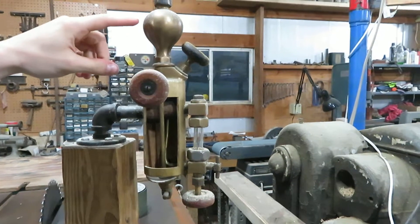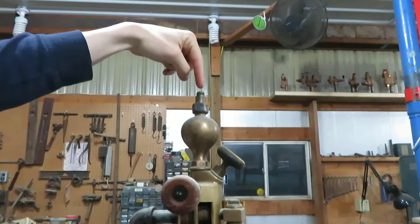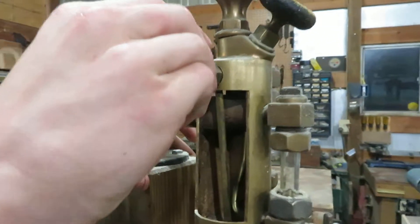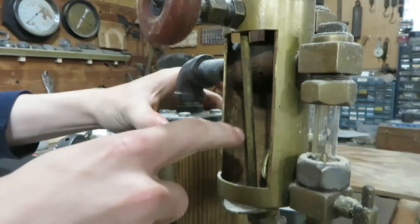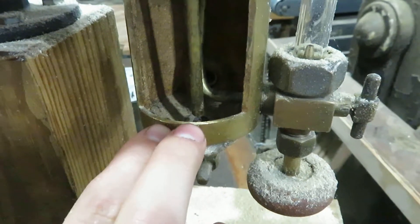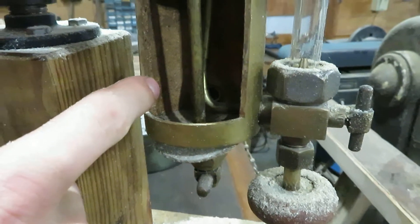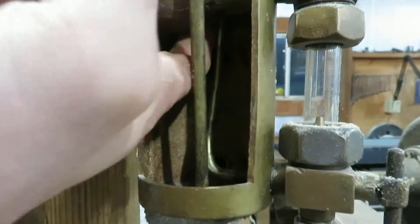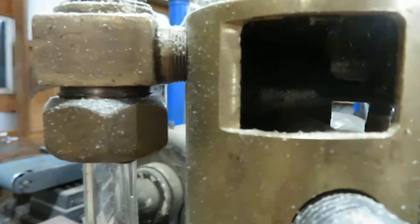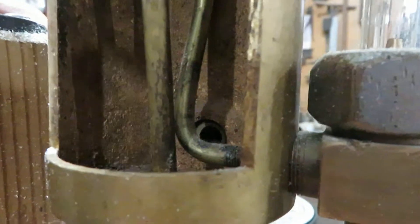This is a single-feed two-pipe hydrostatic lubricator. Steam comes down through here through a pretty long pipe to cool it off, and it condenses inside this bulb and collects there. When you open this stop, it comes down as hot water through this pipe and lands in the bottom. This is full of oil — as the water enters this space, it pushes the oil up because water is heavier than cylinder oil. The oil can only leave in one direction, which is through this upward-facing draw pipe ending up top here. The oil is then forced down this tube to this metering valve right here.